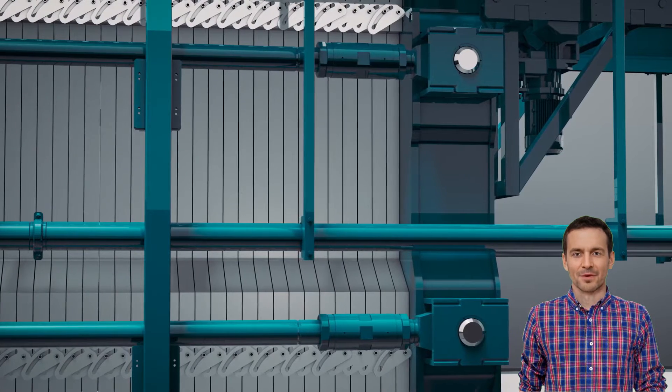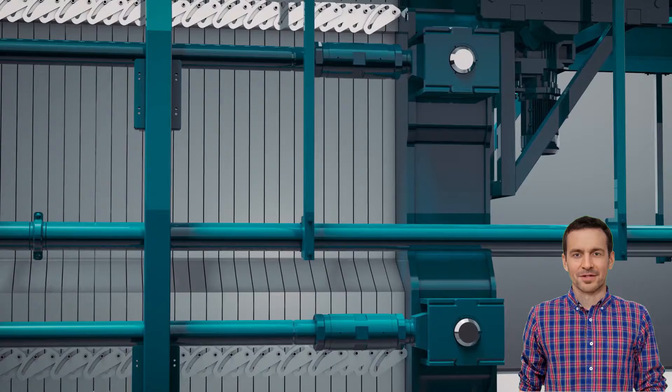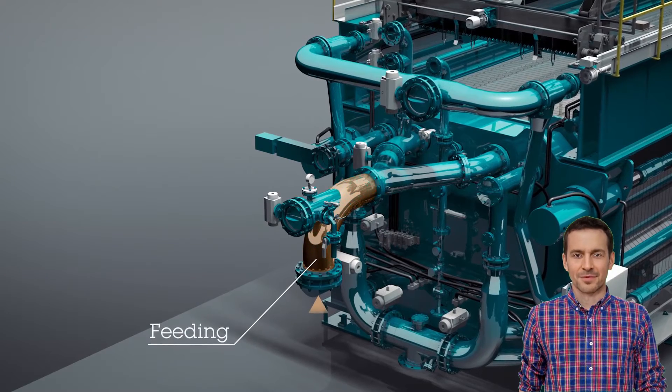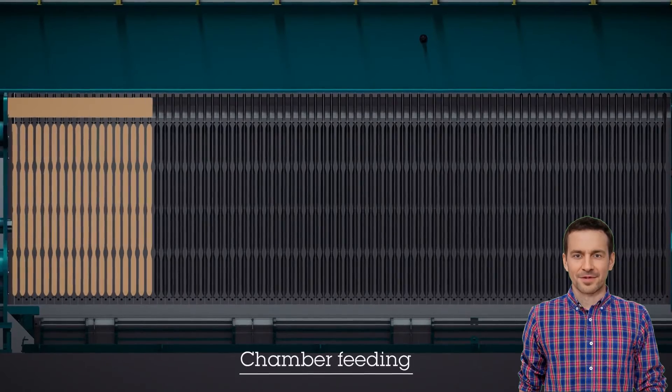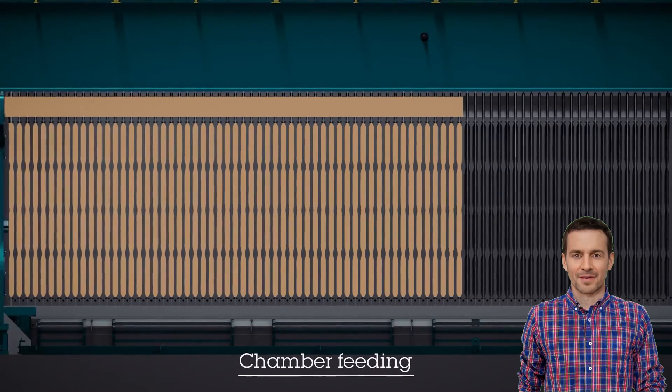I've yet to see it leak. As we work with abrasive materials, wear considerations are always an issue. To reduce high wear in the press, the slurry is fed into the press through two feed pipes, sized to allow the press to fill quickly but at a low velocity to reduce wear.